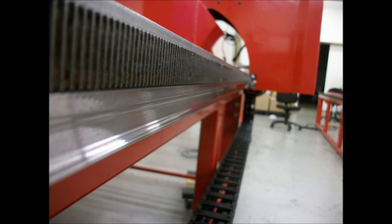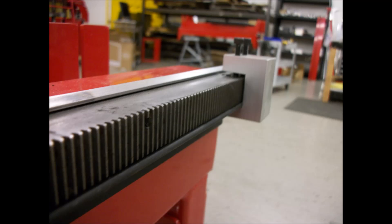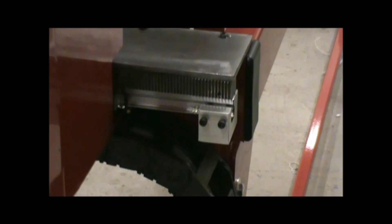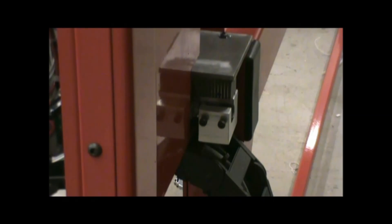Wide-faced 24-pitch gear racks assure quiet operation with long life. The racks point away from the cutting to avoid spatter and damage, and are oriented to allow dust and dirt to fall out rather than get trapped. Adjustable hard stops are used for homing rather than limit switches that are known to fail often — this is more accurate and repeatable. When homing the long axis, both motors are checked as they stop against the blocks, encoders are zeroed out, re-checking the gantry for squareness every time the machine starts up.